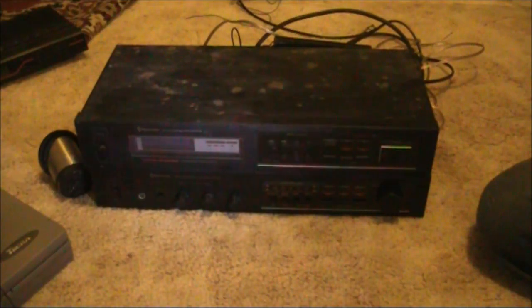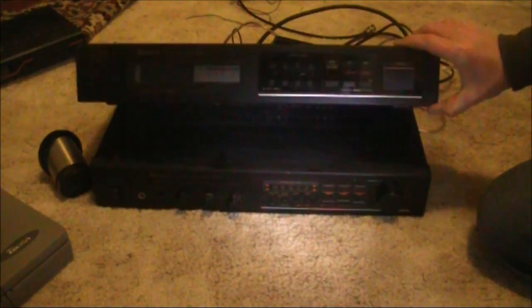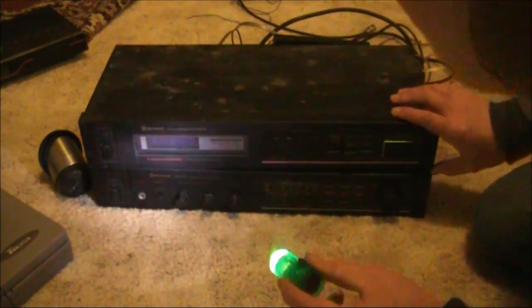Here's another item — the lighting isn't very good so hopefully you can make it out. Actually, two things: a Sherwood amplifier with switches for different sources. Having looked at the information on the amplifier, there's stuff on the web about it — I think it's about 30 watts per channel. The phono input is potentially useful because of the phono pre-amplifier; it's probably got more gain than the other inputs, so that might be useful for various receiver projects. I have in mind a binaural receiver, a very simple direct conversion type, and that will need a high-gain stereo amplifier, which is what this is.